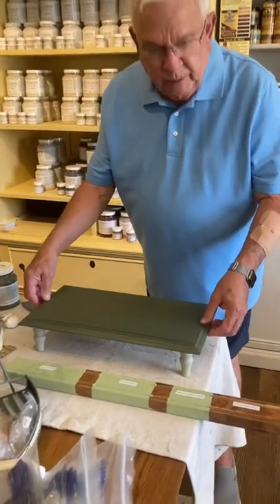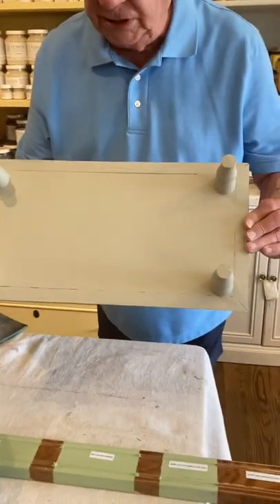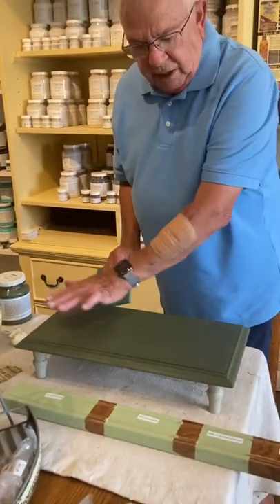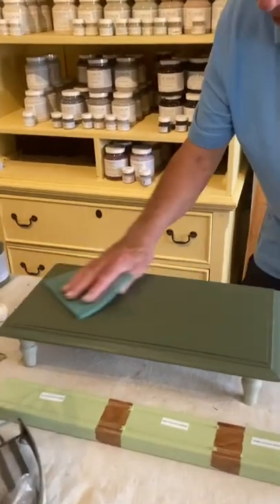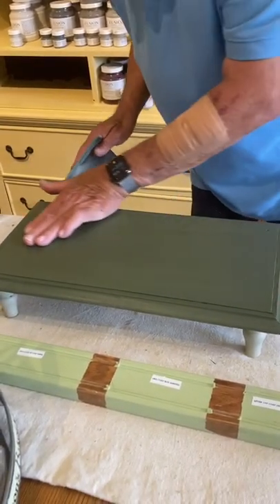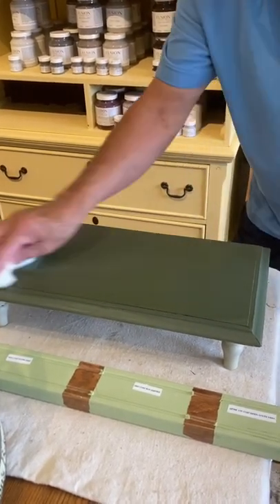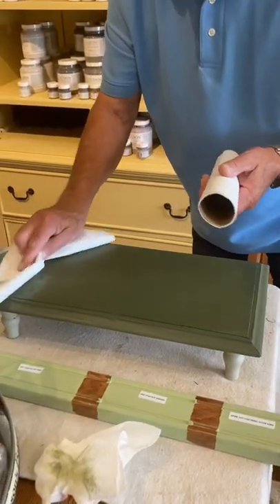Okay, we're back. While we were away I took the opportunity to paint the bottom using all the same techniques — the same sanding and so forth. The top is all done with the second coat. The second coat has a built-in top coat on it, and just a little bit of scrubbing across — very lightly — gets that smooth as glass. We're going to come back with our TSP, wipe off the powder, then dry it. And we're done. This project is finished.